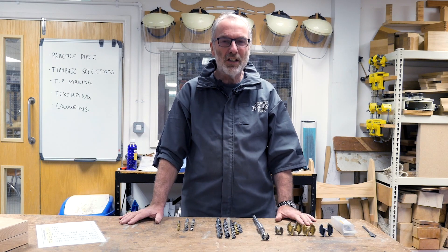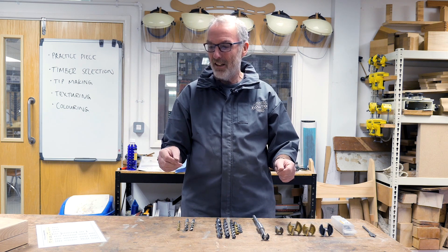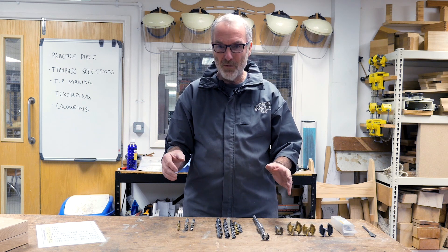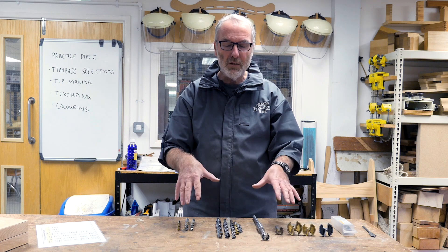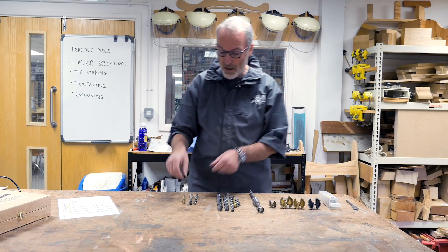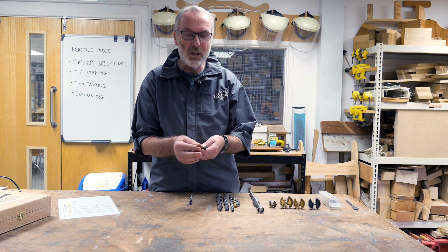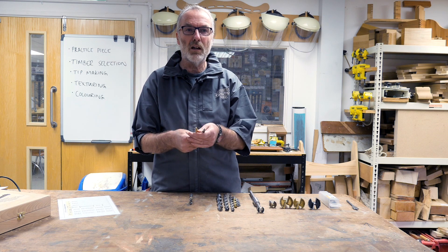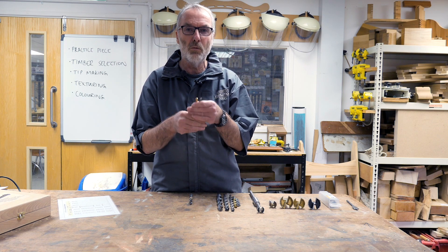Hello, my name is Keith Thompson, this is another one of the how-to-do-it videos. This started out as a request to explain how you drill holes in things — it's a really difficult subject, so I'm going to narrow this down to explaining what the most common types of drill bits can do. To begin with, you've all got a tin at home with a load of twist drills in them. These are meant for metalwork but are equally good for acrylics and for wood.